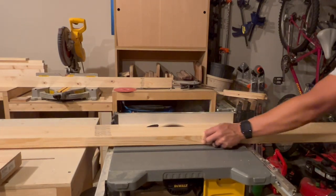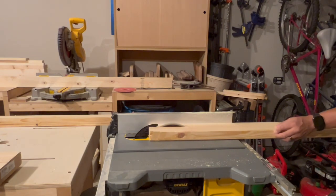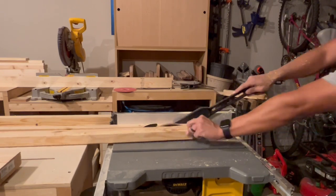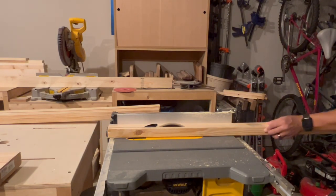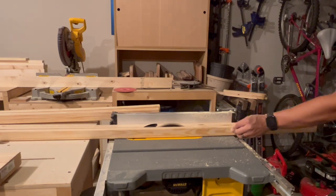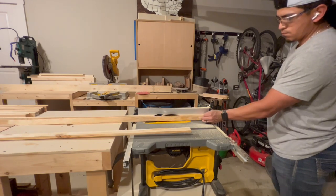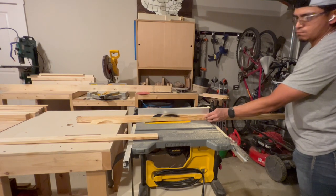To start off this project I started with two 2x6's — all the material I would need. I ripped down the 2x6's into one and a half inch pieces to give me my 2x2's. This gave me six 2x2's, and out of those six I chose the four straightest pieces to use. The other two I used for the smaller square accent pieces for the obelisk. The leftover thinner pieces came out to be three quarters by one and a half inches, and I used those for the smaller pointed pieces on each side of the trellis.